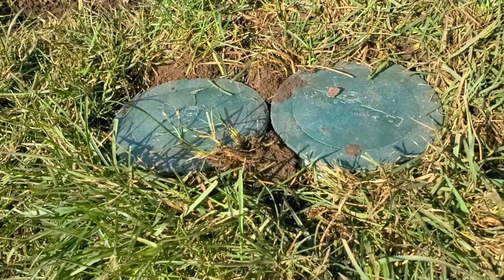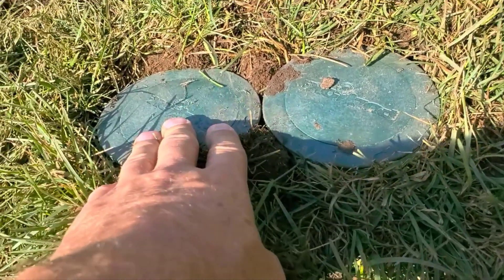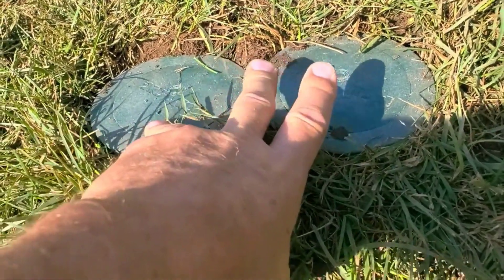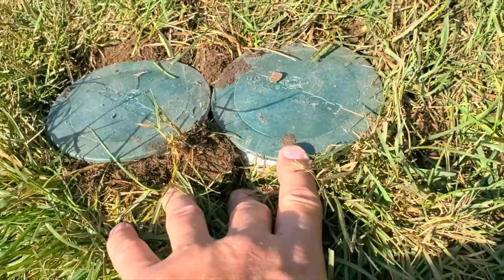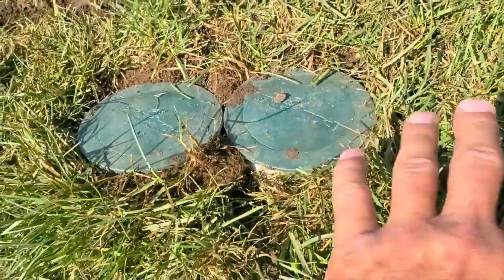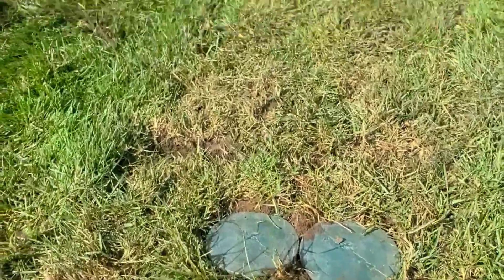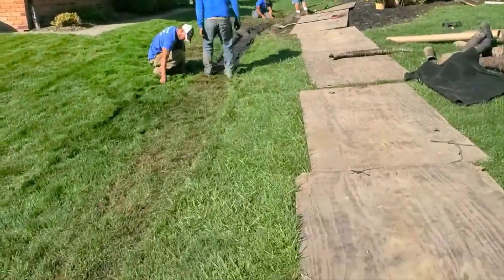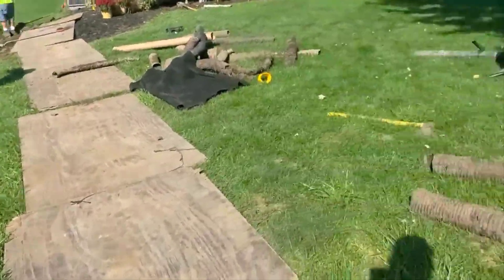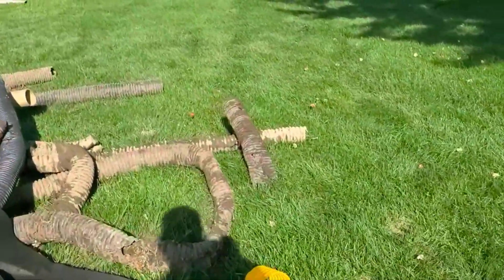Here's a good visual — that's how the pop-ups look when we're done. One of these is for roof runoff, the other is for a French drain system. When the roof one opens up and you have leaves and shingle gravel, it's just going to end up in the grass and the lawnmower is going to mulch it — not a big deal. It comes right out. The way we vent and put clean outs, homeowners a lot of times will just run a garden hose through.